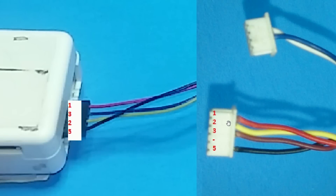Orient your connector the same way as shown here, with the pins facing the bottom. The difference between the Pixhawk and the APM 2.6 is you'll have an extra space between pins, but it'll be exactly the same setup. It doesn't matter if you have different wire colors — just take a picture or make a color chart so you don't get confused.